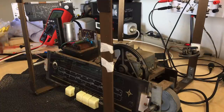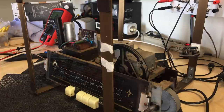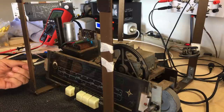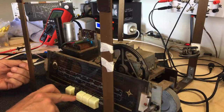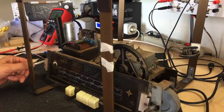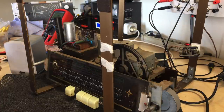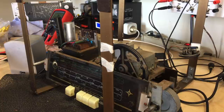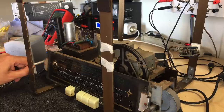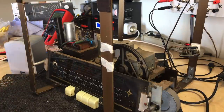OK, we're going to do another test now. I've recapped everything that needed recapping and I've done a test and we've got a bit of a quirk here. We've got it on medium wave, dim bulb is on at maximum restriction. Switch it on — the speaker is over here, it's drawing 60 milliamps at the moment. Do we have any life? Yeah, we've got something. I've got the mini whip antenna at the back.